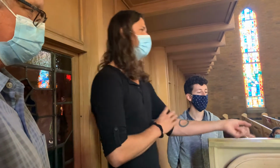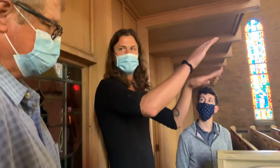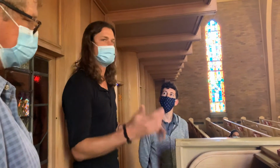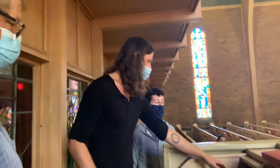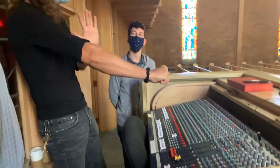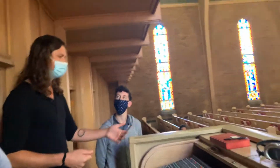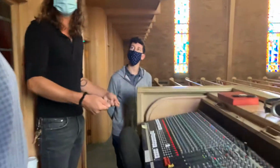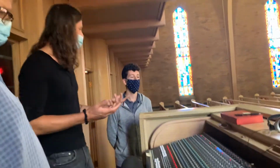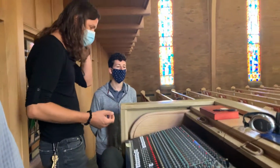The other reason that's useful: let's say you decided you wanted to take down the pulpit lectern mics to clean them or whatever else. It's good practice to undo the phantom power before you pull the cable. Same thing as with any home appliance that you plug in with the power already on. Cut the power first. It's just not good for it over time, to do that as habit. I doubt you guys really do that all the time, but yeah.